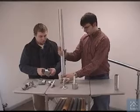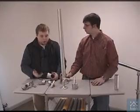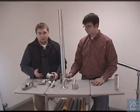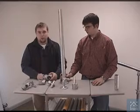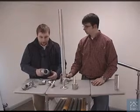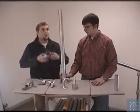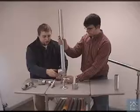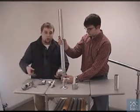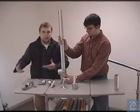Moving on from the base, what's the next piece that we need to build a certified handrail? If you're building it for a ramp, the chances are you're going to be needing a base rail. Any time your ramp does not have a wall right adjacent to the ramp or a curb of some sort, there has to be something protecting the wheelchair from slipping off that ramp. This fitting is a variable angle fitting that allows you to put another size 8 or inch and a half pipe coming off at whatever angle you need — whether it be 2 degrees or 10 degrees — to make that base rail so that the wheelchair can't slip off the ramp.